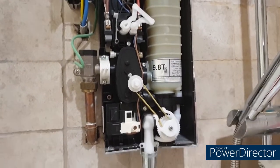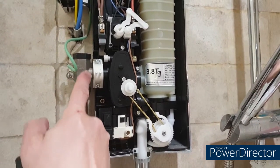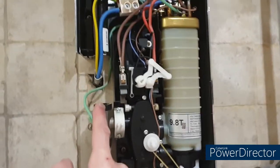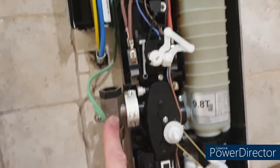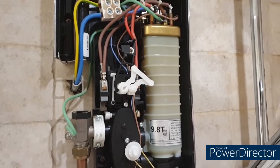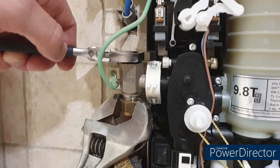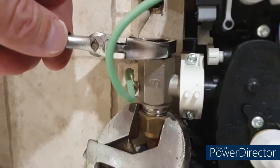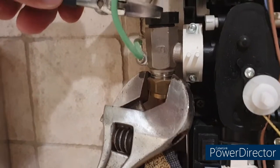That gives you access to the water supply from the mains and up into the filter, which is this part here. What we're going to do is remove that black nut on top, which gives us access to the filter. I'm just going to get some spanners, turn off the water, and tackle that. Using a couple of spanners — one on the bottom to stop it turning round and one on the top — and I've got a rag there to catch any water that falls out.